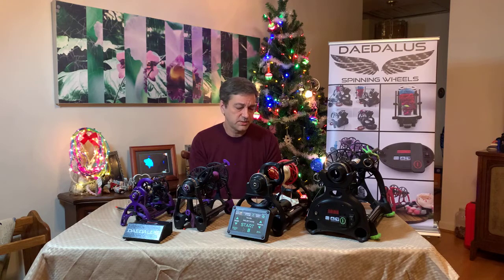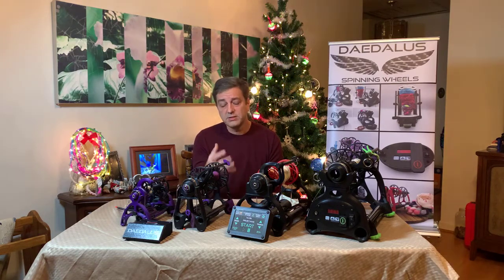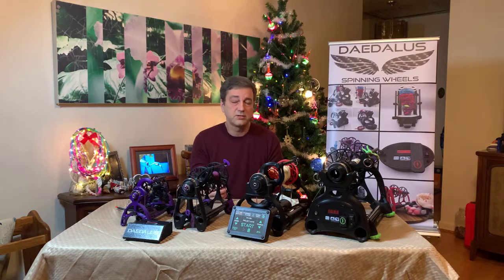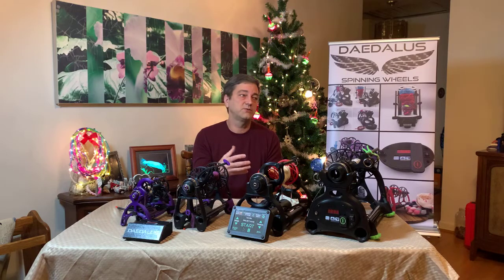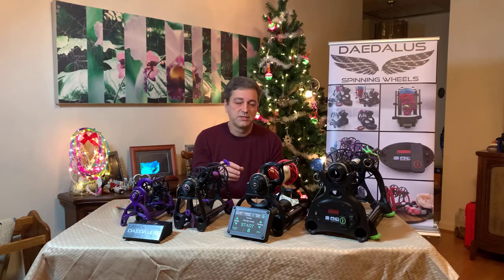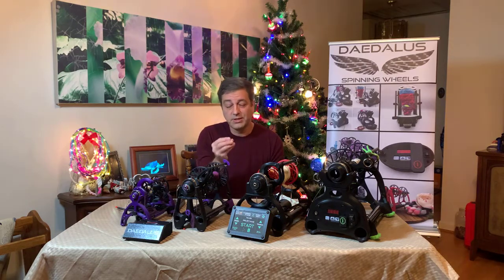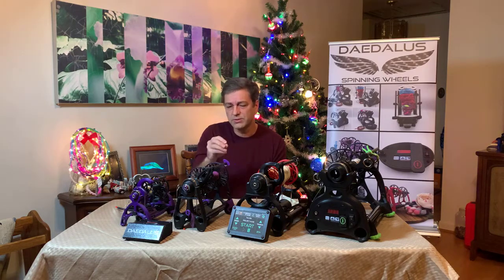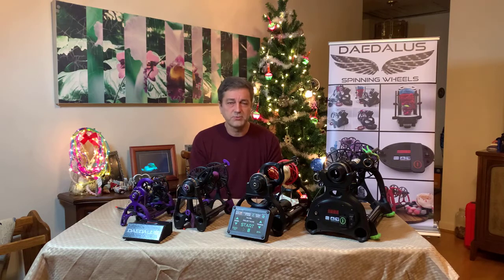Raven is an interesting wheel for a couple of different reasons. It's not just that it uses 2 motors. The bench testing that I've done historically on Raven with the 2 motors has been with what's called an electromechanical solution. So basically I use resistors and rheostats and potentiometers, electrical things, to basically put it on a knob so I could kind of control the speed of the rear motor, or what the rear motor was actually doing with a knob at any given time. And that was frustrating for me. I just knew it wasn't going to go over. I knew it needed more refinement than that.